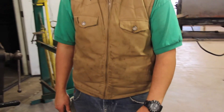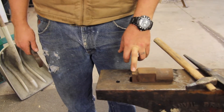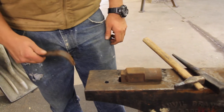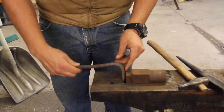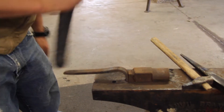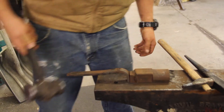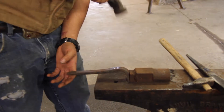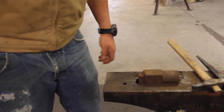What we've got is a block here. I like to use a piece of one inch and then grind it down to about seven-eighths to three-quarter through the thickness. Then you take a piece of steel, put a taper on it, and bend it at 90 degrees — that gets it out of your way. Then you just knock it down into the hole and you've got a block that's nice and solid. If you need to get it out, knock it back and forth and there you go.